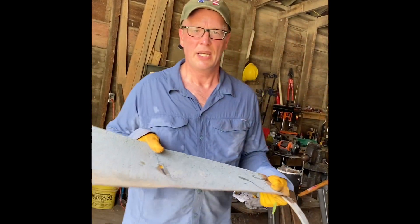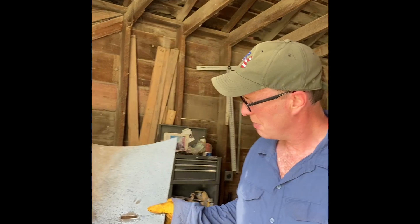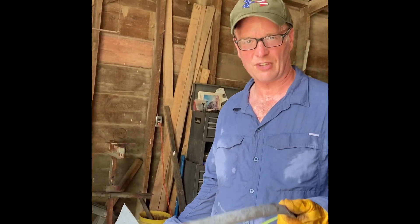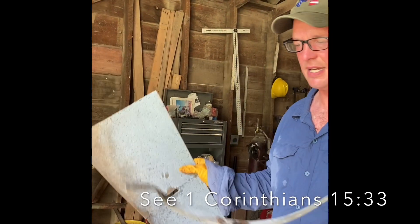This one hasn't been rolled. When the wheel was all together, it looked like every single blade was going to need to be straightened out. But a lot of them are like this — once we released them from the outer bands, they straightened up on their own. So it wasn't the blade that was bent; it was the outer band that was a bad influence.